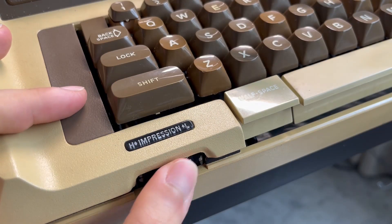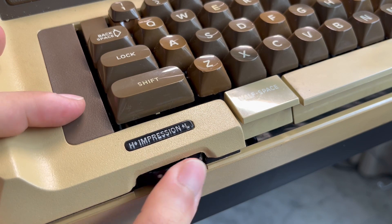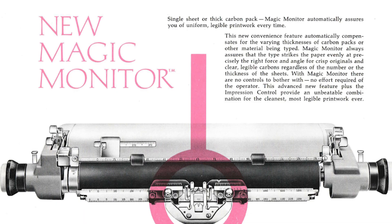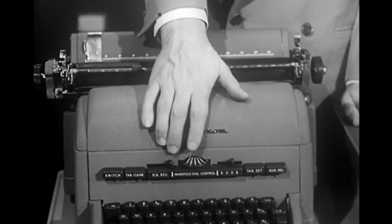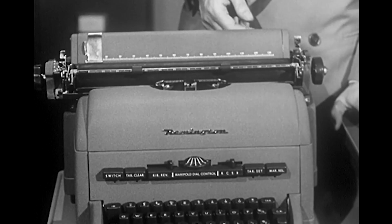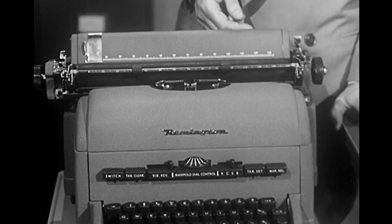The result is a uniform appearance on a typewritten page. Some of these typewriters even included adjustments or sensors in order to allow you to vary the strength of the typewriter, while simultaneously allowing the operator to simply use a light and gentle touch on the keyboard in order to generate more carbon copies. By simply moving this impression control, the typist can increase the number of clear, legible carbon copies with no increased effort.